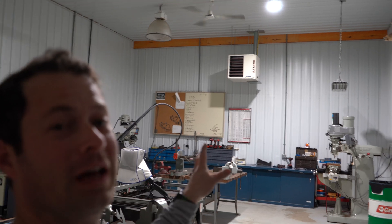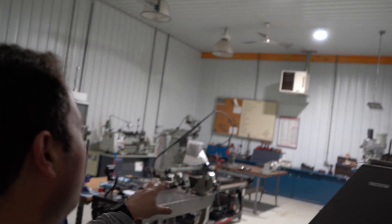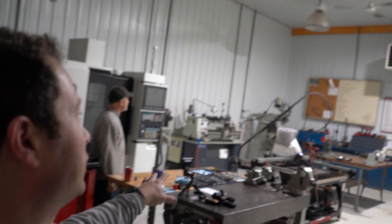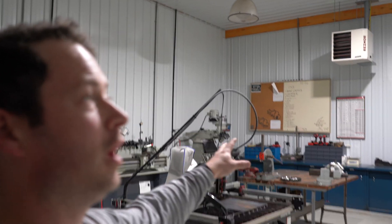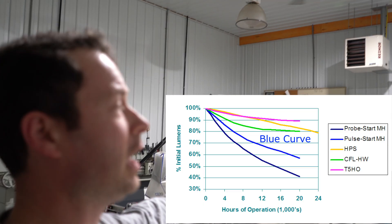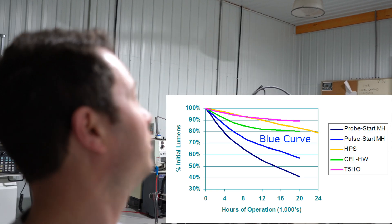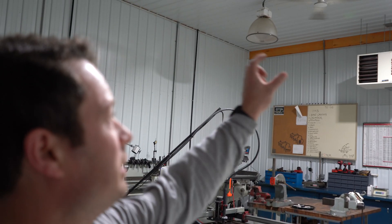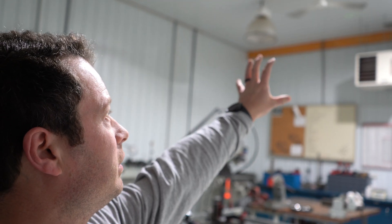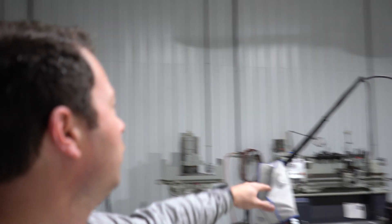Now the only two lights in this entire 20-by-40-foot section are the two LEDs, and honestly it seems almost as bright as it was before with all six metal halides. These are aged metal halide lights — they do have a depreciation over time and probably had around 60% of their full brightness left. But even still, just look at the form factor of these LEDs: they're tiny, they give you a lot more ceiling space, you don't need the big deflector, and they really do spread the light out very well. And obviously they're way more energy efficient.